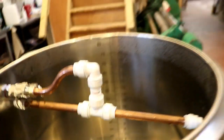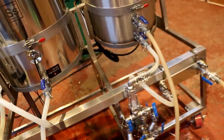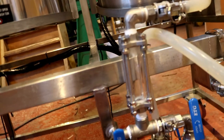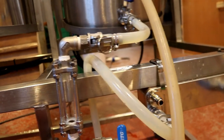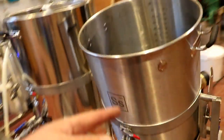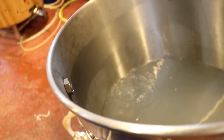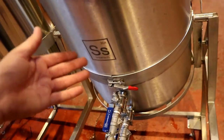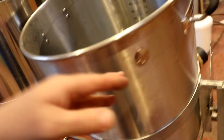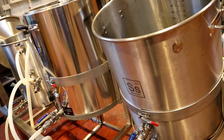There's still some liquid in the mash tun, so we'll put that up there so we don't lose it and turn on the boil pump — and there we go, that's now pumping through the plate chiller. It will eventually recirculate back into the tank once this airlock disappears. I also moved the return arm on the side — I've put an elbow at the bottom and taken away the short bit of pipe, because I had a hole at the front of the tank and it enabled me to shorten the hoses. The original front hole remains plugged for now — maybe nothing will go there, we shall see.